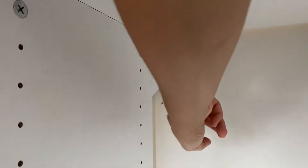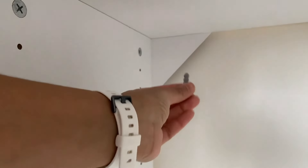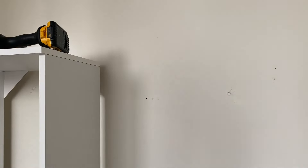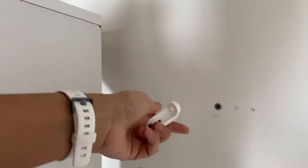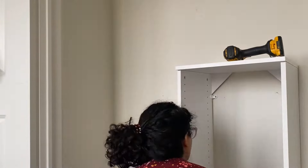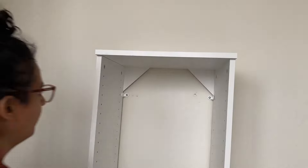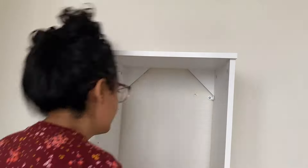I'm ready to install this into the wall, but I need to anchor it for safety — we don't want this falling down on anyone. My stud finder told me there were studs here but there weren't, so we're going to make a hole and use the wall anchor that came with the kit. You always want to try and get into a stud, but in this case I'll just use the wall anchor and attach the bracket first. I love that the closet system comes with anchors, nails, and everything — no need to buy anything additional. Once anchored to the wall, I also need to secure the anchors into the actual cabinet.